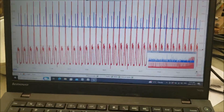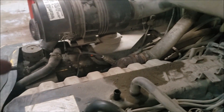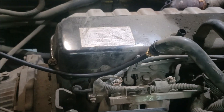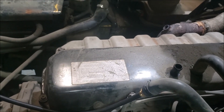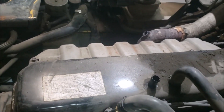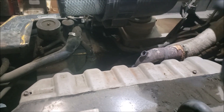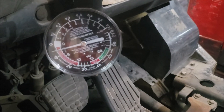Now we really have to determine whether to break that bolt — heat it up, open it up, and see if the vacuum improves. We already know from our in-cylinder pressure transducer test that we are dealing with a plugged exhaust. This now gives us enough evidence to spend the time to get that oxygen sensor out. And now it's out, with the vacuum gauge still connected.